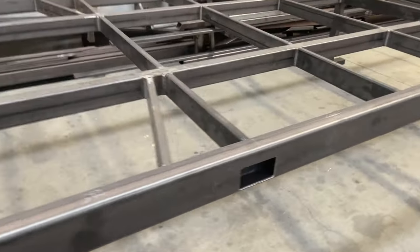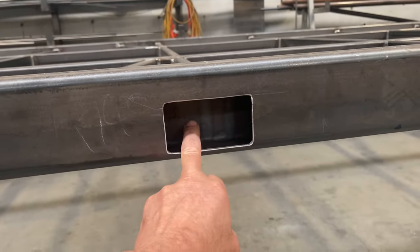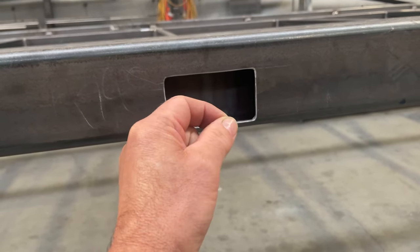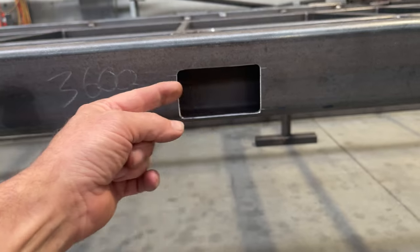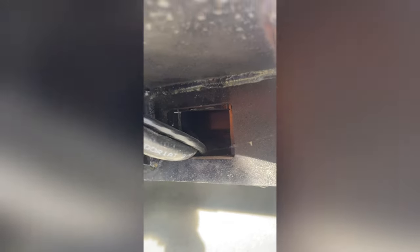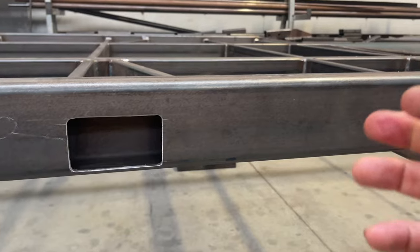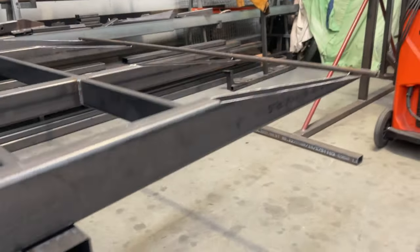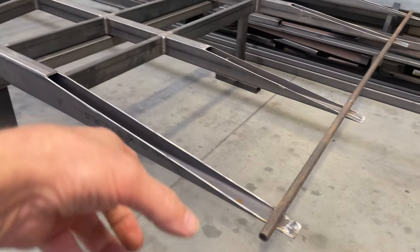The services run all the way down the inside of this. At the first hole, we bring the air out which goes up into the airbag, and one bit of electrical wiring comes out and runs the front side lights and the front brakes. That's part of the loom that goes past along with the other air line, and out of the next hole we bring the airline that goes up into the second airbag. If you're running your lights on that airbag mounting component, the electrical wiring comes out there too. In some countries you'll have to put your lights further back towards the rear of the trailer — you might feel comfortable putting them here or right on the back.